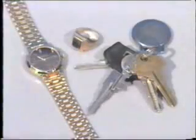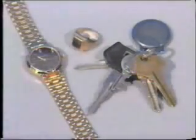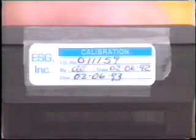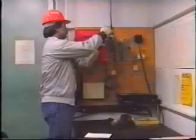It is good practice to remove personal items such as wristwatches, rings, keys, and so on, as they have been known to contact live circuits in delicate relay work and cause damage and perhaps injury. When performing functional testing, be sure that your test instruments are calibrated and in good working condition. Test leads must be well insulated and free of cuts and abrasions. Always use the proper tools for the job. Wear your protective gear when necessary, and above all, do not become distracted.